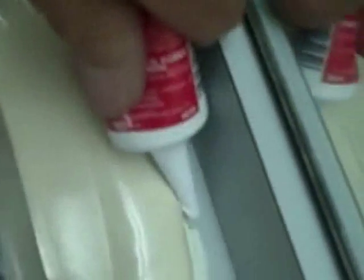Again, slowly, patiently — fill them back in again a little bit. Now I'm going to have to get on the other side over here and do the caulking down around the other side. Again, I'll have a big lump back there because it's hard for me to get in there, so I'm just going to put excess back there until I can get the tube down and back in the position that we want it to be in. And we get that nice even look back there — see that? And we're coming around to where our edge is here.